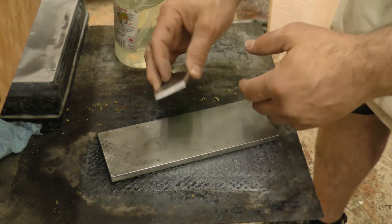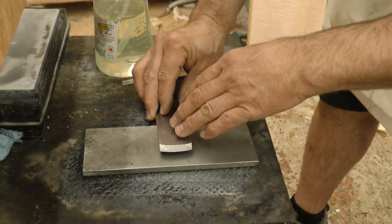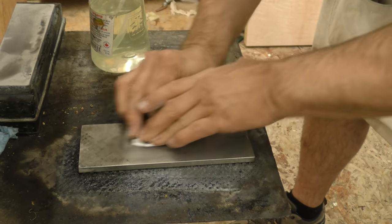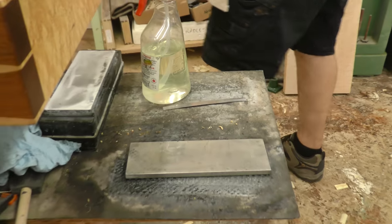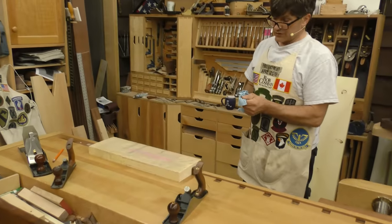So now all I'm going to do is lay this over. I don't use the ruler trick on this — you can't, you'd end up with a little flat spot right there. I always like to set the back down first up here and drop it down, and then just a couple of strokes to remove any burr. Think of this more of an axe than a hand plane — it's used to go in and just rapidly remove stock.